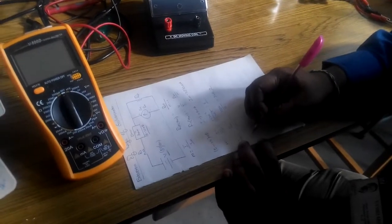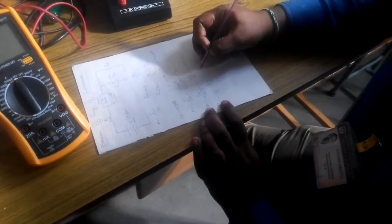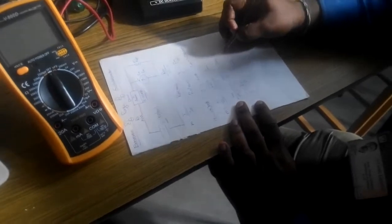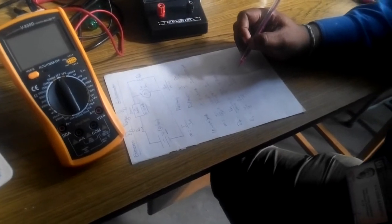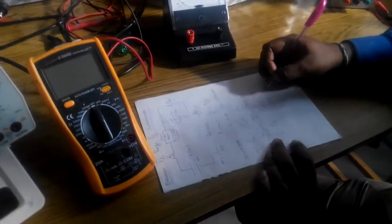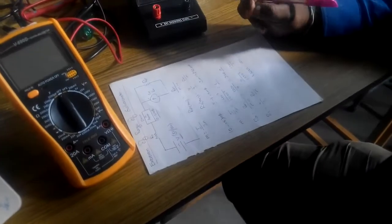The value of Rs is: Rs = V/I − Rm/M. Assuming V = 5 volts: Rs = 5 / (1.5×10⁻³) − 1200/6, which gives approximately 3.33 kilohms minus 200 ohms, so Rs is approximately 3.13 kilohms.